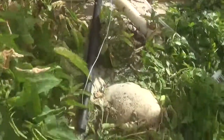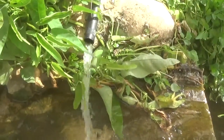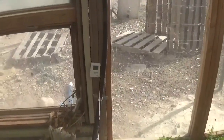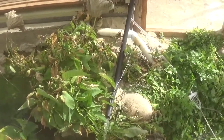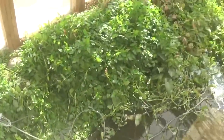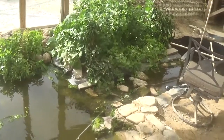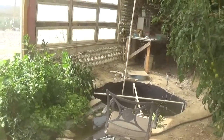The pump has three speeds: low, medium, and high. I put it on medium right now just to see how medium works. It would probably come out a couple degrees hotter — maybe three or four degrees hotter — if I put it on low. But the volume of water I'm getting is important because it's a 4,000-gallon system. So the water goes in here and then flows down that little creek into the 900-gallon tank.